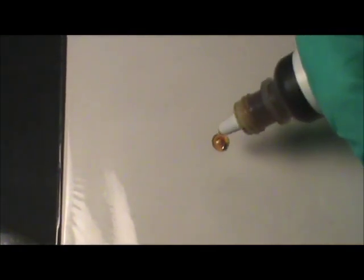Sterling silver is actually almost like butter when you cut through it with a blade. It cuts very cleanly. Something like this requires 1 drop of nitric acid. You should put an extra drop. You should be able to see the reaction fairly quickly. You can see how powerful the acid is. You're getting an immediate red reaction, which is exactly what you want. Yeah, I can smell that already. So that's definitely sterling.